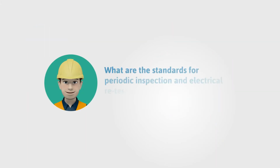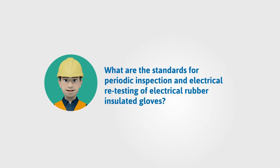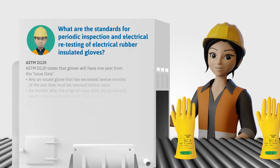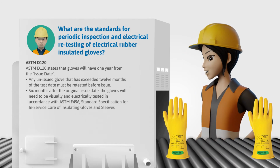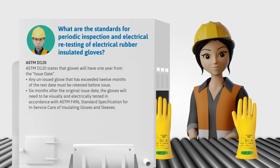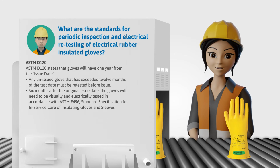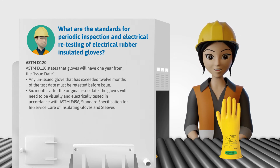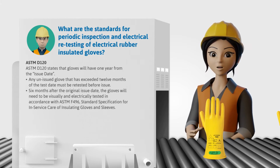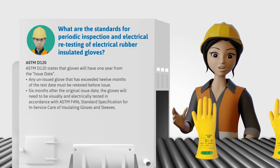What are the standards for periodic inspection and electrical retesting of electrical rubber insulated gloves? ASTM D120 states that gloves have 1 year usage from the issue date. Unissued gloves that exceed the test date by 12 months must be retested. Gloves will need to be visually and electrically tested in accordance with ASTM F496 6 months after the original issue date.